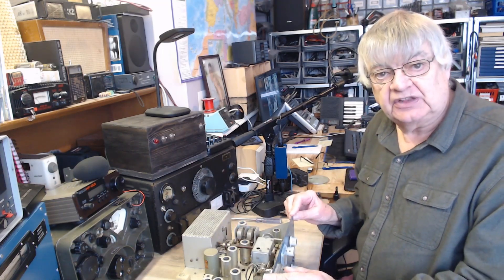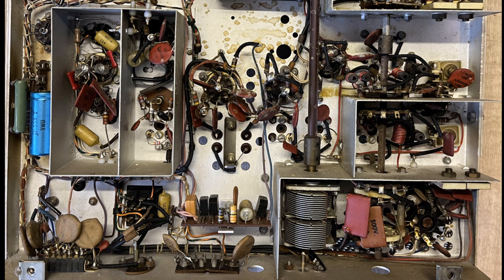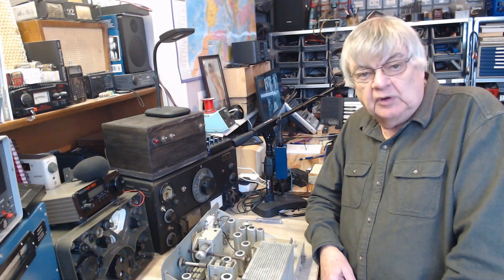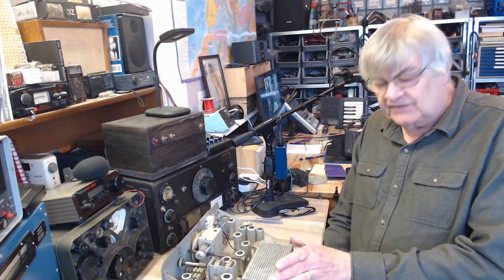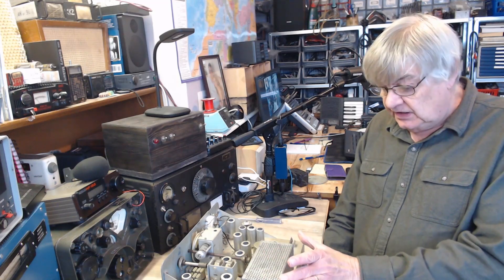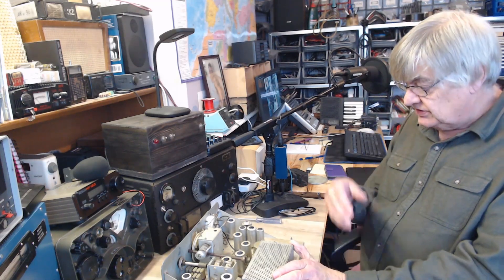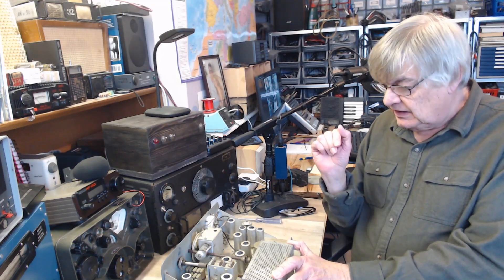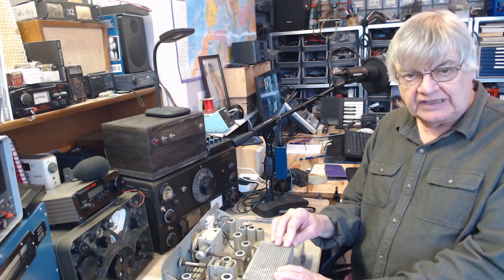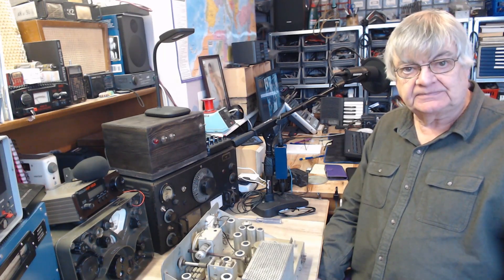What is it — Mark One, Mark Two — what's in there? There aren't a great deal of capacitors underneath that need replacing; they're mostly silver mica types. One or two little Mullard — do you remember the Mullard mustard capacitors? A few of those, and what I used to call soufflé capacitors — Styroflex or something — they will want replacing, there's only a few of those. I've just been checking: the Mark One — which this is — uses the 6146 valve. The Mark Two, which is 220 watts PEP on sideband, 150 watts AM, 150 watts CW, uses the 6HF5, the 12-pin strange valve. So this is the Mark One — that's settled — 6146 in the PA.